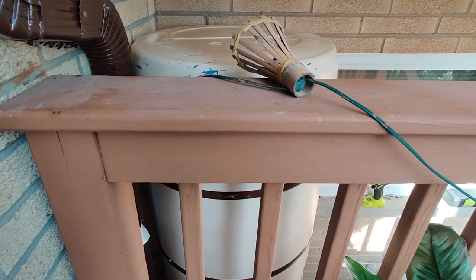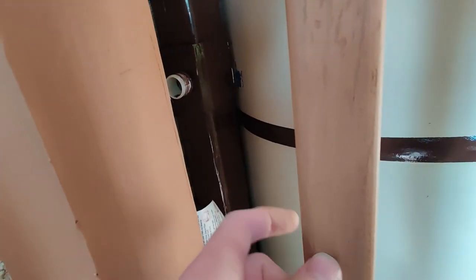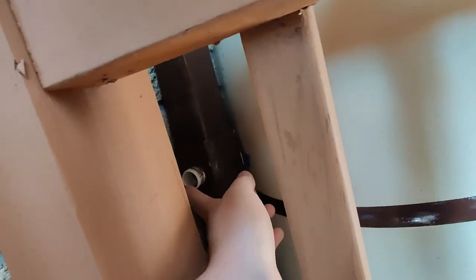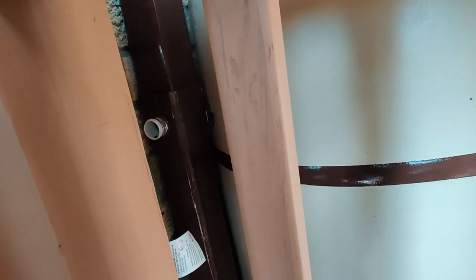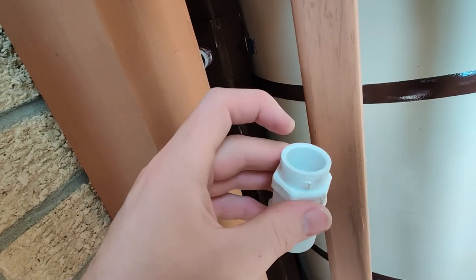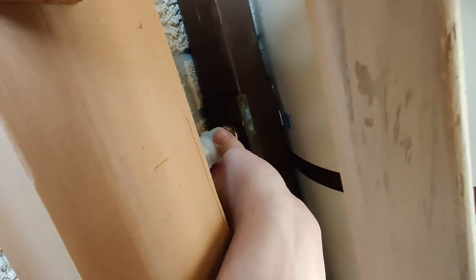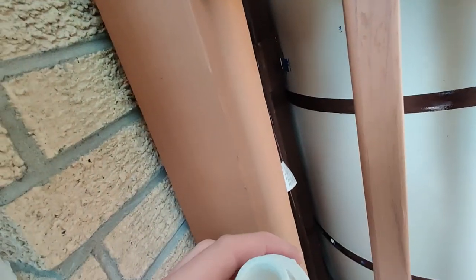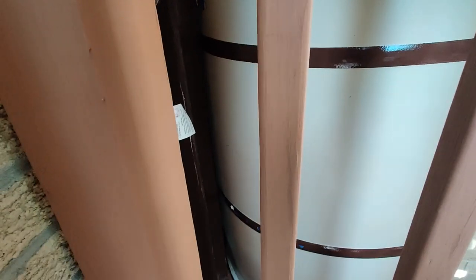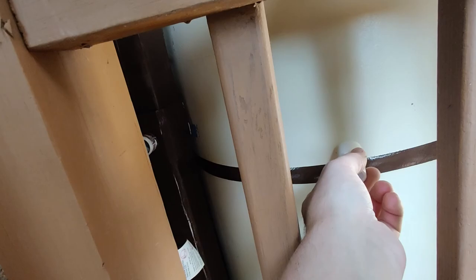I'm figuring out how to get the downspout adapter connected to the rain barrel. I basically need to go from here over and into here. On the last video I talked about using regular hose to connect it and then caulking it in, but the hose kept crimping because of the tight radius. So instead I'm going to use regular 1-inch PVC pipe — a hose adapter piece with a 1-inch male end connecting into here. Then do a 90-degree elbow across and put a valve in there where I can turn it on and off in the winter. Then add a coupling that can disconnect by just unscrewing it, so if we need to remove the rain barrel it's easy. Then go into a 90 and straight in with a male threaded section, drilling a hole, threading it in, and caulking around it.